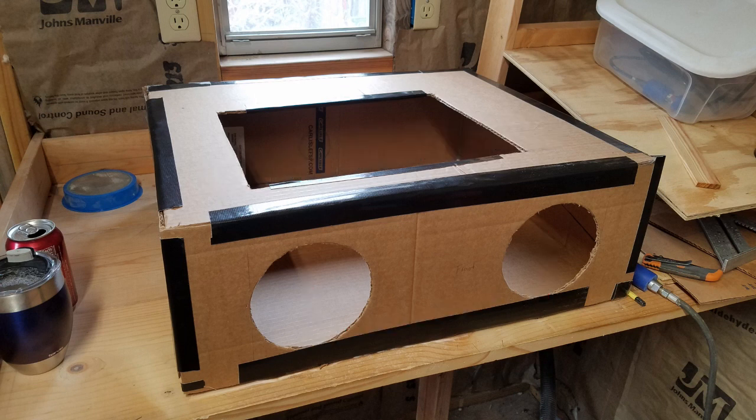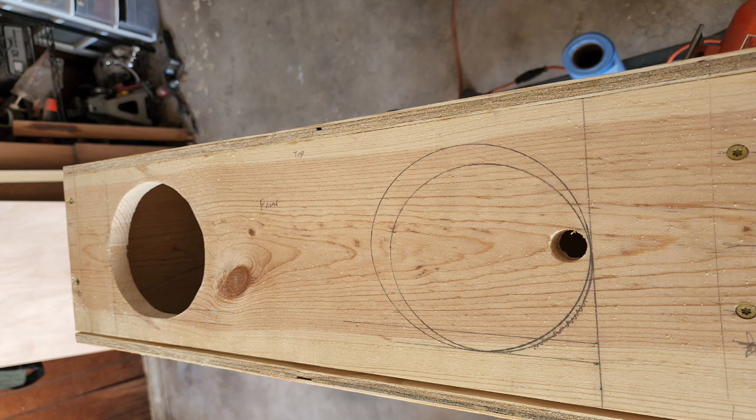The diameter of the holes depends partly on your needs and partly on what your end design will be. If you're just leaving the holes bare, you can make them whatever size you want as long as they fit the board — you should leave about an inch on the bottom since the front panel is also the closing lip of the box. If you are planning on using pre-made blast cabinet sleeve mounts, use those as a template for marking the cutting line, making sure they are centered on your armhole measurements. Start by drilling a hole on the inside edge of the cutout — you can use this as a starting place for your saw to cut out the holes.